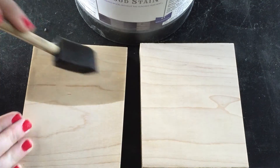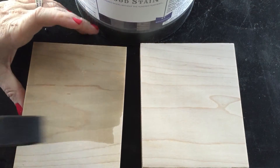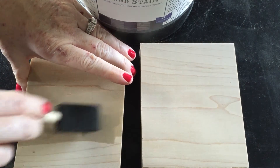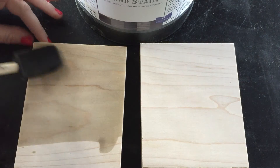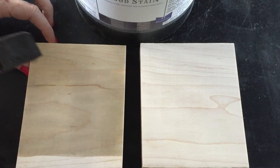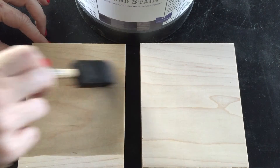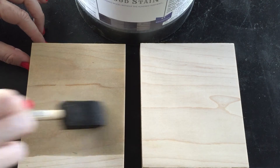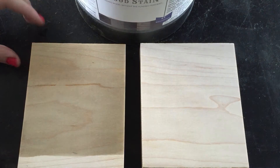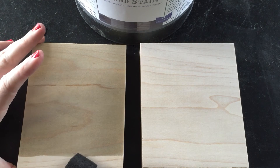Reclamation is a gorgeous color on hard maple. You can see that it's a reactive stain, so the wood is actually going to react to the stain itself, versus the stain having pigments, dyes, or colorants — which can both be harmful as well as cover up the grain.